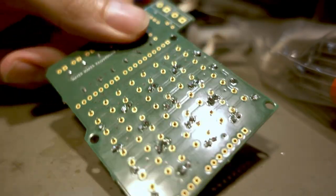We're using a keypad where you enter digits plus some symbols to make the code harder to guess. For feedback, we're using normal LEDs — for every digit entered, one LED lights up, and when they've all lit up, the unit checks the code and activates the relay if it's correct. If not, it goes back to its normal state. Also, the code shouldn't be forgotten on reboot. There's a lot to think about in hardware and software — let's start with the hardware.